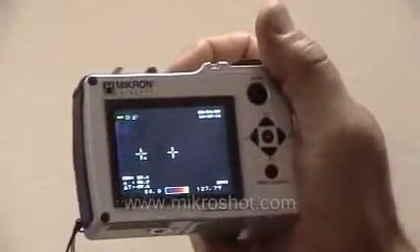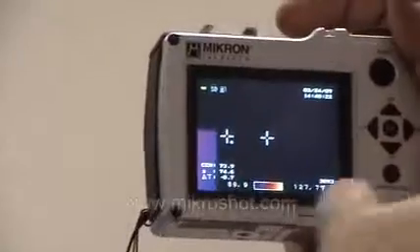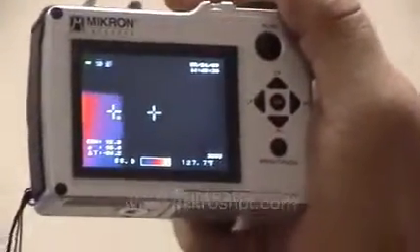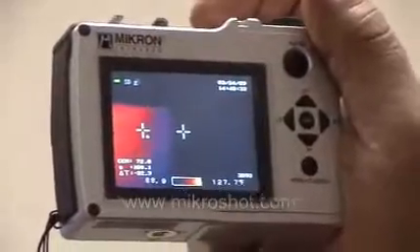To turn on the camera, simply press the on button, wait for the green light to illuminate, and literally within seconds you'll have an infrared image appear on the screen. At that point, you'll notice that there is a fixed center cursor and a user adjustable cursor, a differential temperature between the two cursors, and the user can also bring up a roving minimum or maximum cursor that will find the hottest or coolest point on the screen.